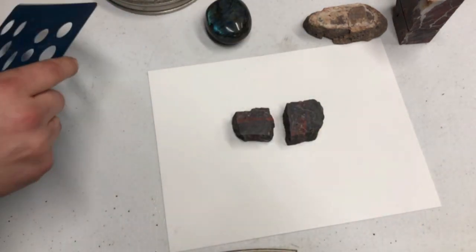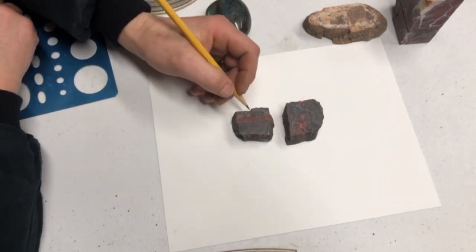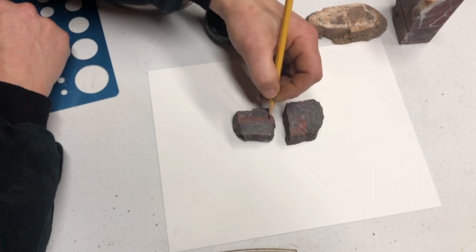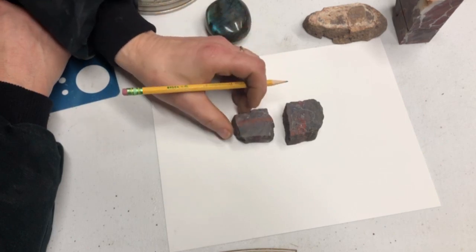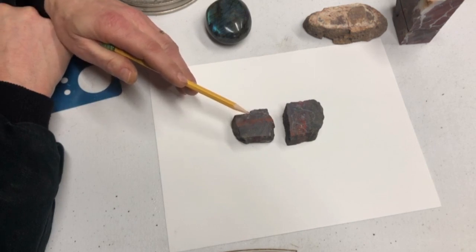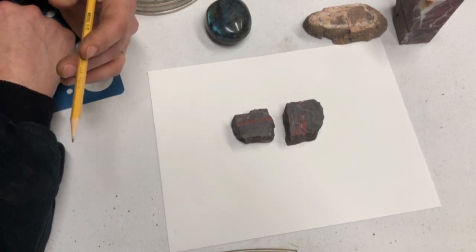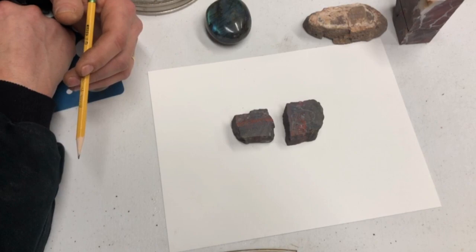And in this case, I'm not going to mark the outside with slop. I'm just going to leave a decent amount of space on the outside. So when I cut with my trim saw, I will probably cut along these lines, just leaving extra space, because it is rare that you can get a piece lined up right on the center of those phenolic pins. And if you're off a little bit and you've cut your preform too close, you're going to end up with a problem with a flat spot.